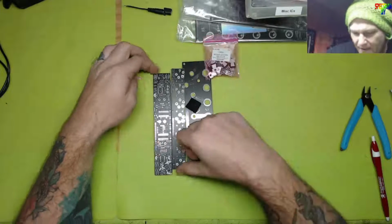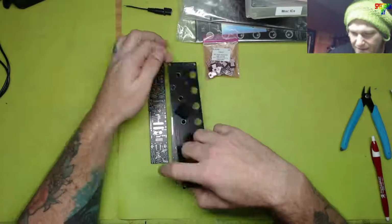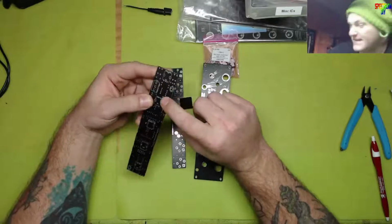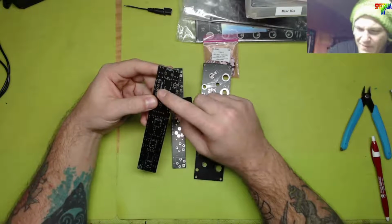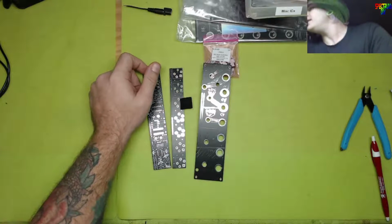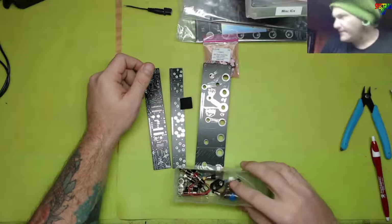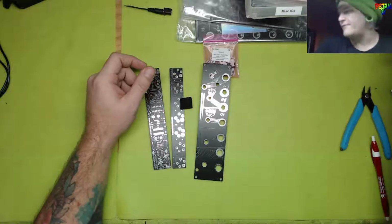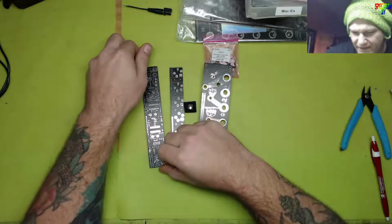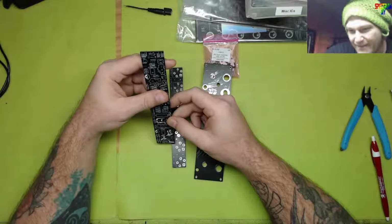The other thing is this switch. I didn't know this was a specific one. This is a momentary trigger switch: on, off, on, momentary. I don't have a momentary on, off, on, I don't think. I'm going to double check. But none of those are the switch kind. Those are buttons. All I've got is the actual switch, which means I'll have to hang on to it and just blip it, which is fine for the sake of the test, but I will change that out. So that's a couple of heads up ahead of time.